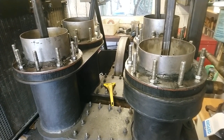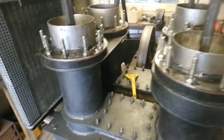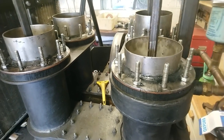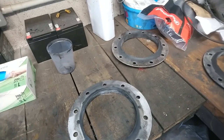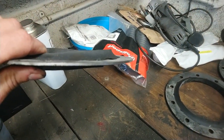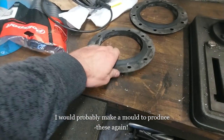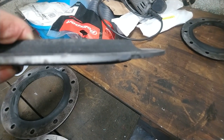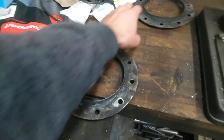I've just done the other side of the lip — the downwards-pointing lip. It's a bit messy, and I'm not particularly happy with things. I broke one of them off trying to get it down over the piston because I didn't check it fitted before I mixed up the resin. The seal support rings are finished — they're not perfect, and it's not the finest work I've ever done. Hopefully it will prove the point though: by putting a support ring with a section like that, it stops the seal folding back in on itself when the piston goes on its reverse travel.